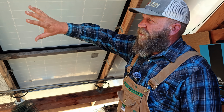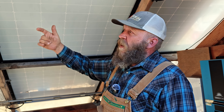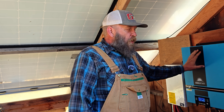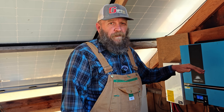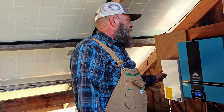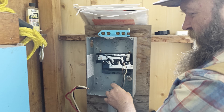All the solar panels are connected in series. Each individual solar panel makes about 40 to 48 volts, but because they're all wired in series and there are eight of them, I end up with around 300 volts coming out — which sounds scary, but more on that in a moment. That wires into this unit, which turns that low-amperage, high-voltage DC power into high-amperage 48-volt DC power. That circuit regulates how much power goes into the batteries, and then that power is converted into AC power, just like in your house, and goes to the distribution center that powers our home.